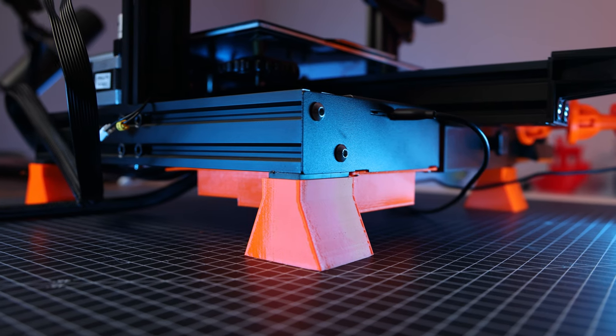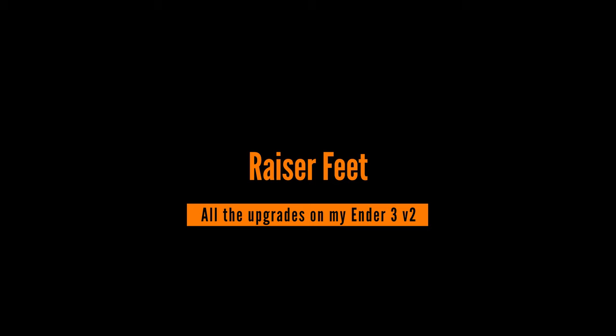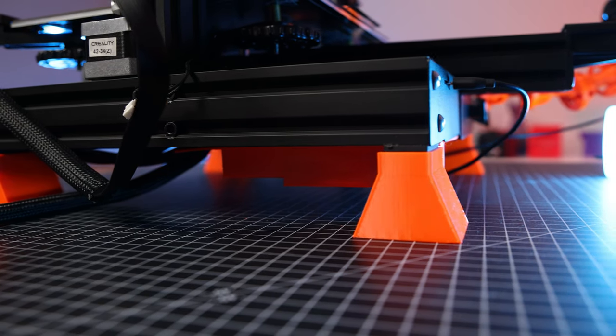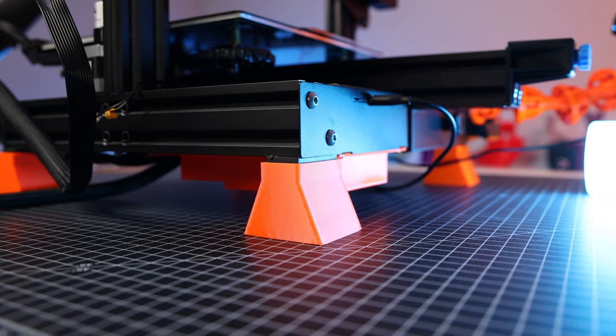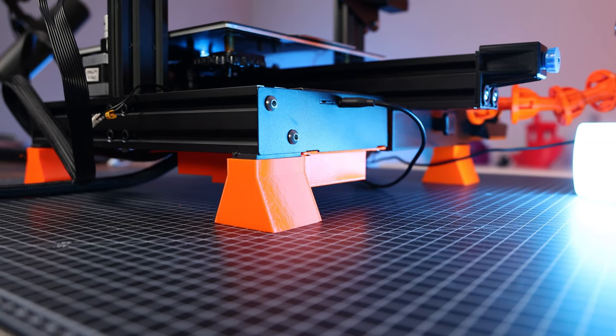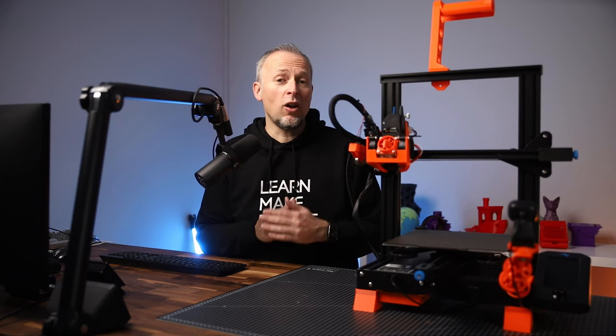With this new case cover, the printer frame needs more clearance underneath. And that's why I installed the second upgrade: raiser feet. Even if you don't install a bigger electronics cooling fan, it is highly recommended to raise specifically the Ender 3 V2 with some additional feet. Both the case cooling fan and power supply fan are very close to the table surface and there could be some overheating when you print for longer time or the environment is generally hotter.